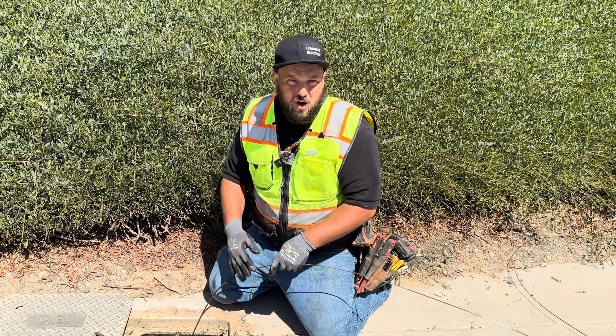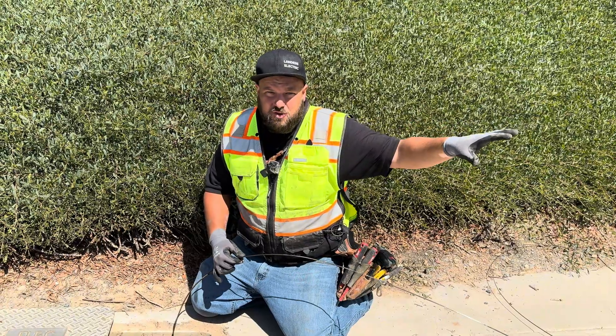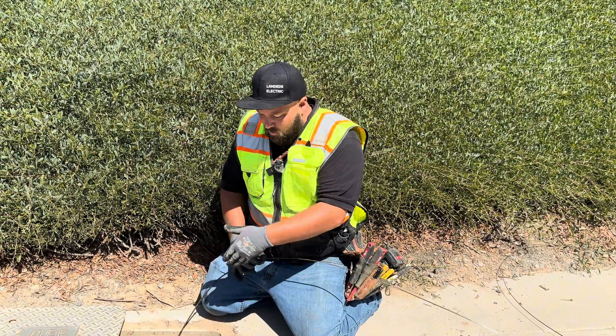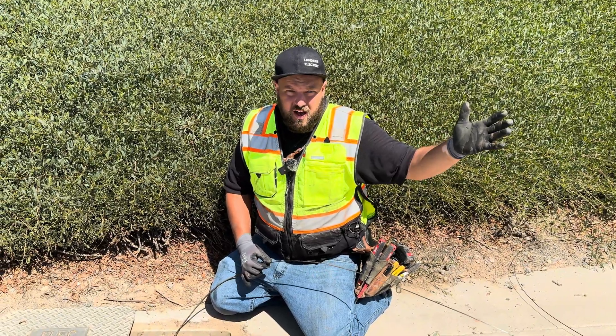These ones are full of water so the water would go shooting up, but as you know here we have some electrical equipment that's live, so I don't want to put a vacuum on this and blow it out and send water up into a switchgear and blow the thing up.